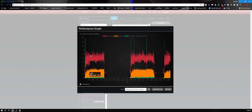If things get stacked and it's doing a gantry level, which I'm pretty sure is what's going on in all of these right here. I just started new prints, right out, or back to back to back. Every time I start a print, I do a gantry level, or do a home gantry level, some other stuff, and the host buffer just gets full because there's not much of a buffer on the 2560.